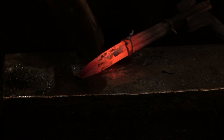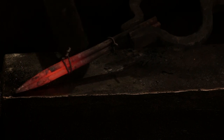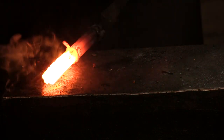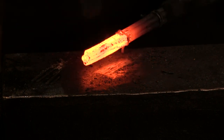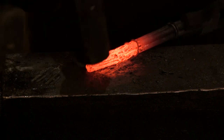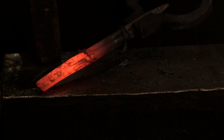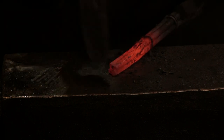I'm going to flip it around and do the back end now. On this side we did want the taper, because we're going to attach it to the handle. But on the back side we're going to fuse this together to make our hook. Flipping it around, we've got a good heat, and I'm going to weld up about two inches. I just want to get this stuck together and square, then we'll put this on our handle and go to work on this end. Once you get quick with the forge weld that'll be all it is — practice, practice, practice.